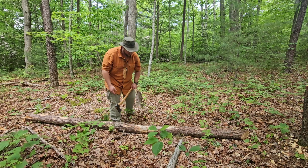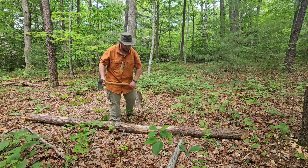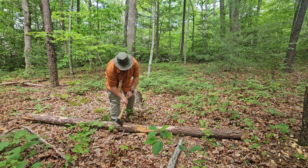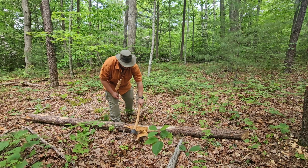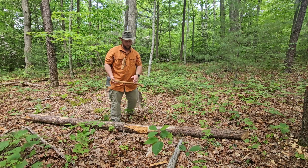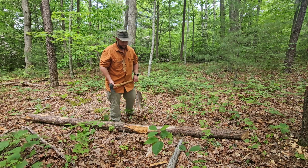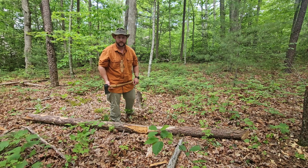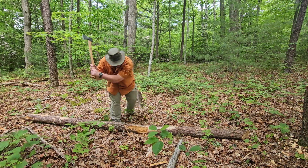And I'm going to make this second cut in a spot right about there, probably. Yeah, right there, if I can get it to stick, which it doesn't want to do. But that spot right there, that's just a little bit wider, this area here, just a little bit wider than the diameter of the log. And that means that as I progress through this cut, that V won't bottom out until I reach the other side of the log. So that's the purpose for that.